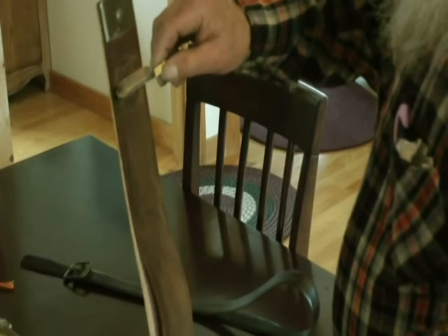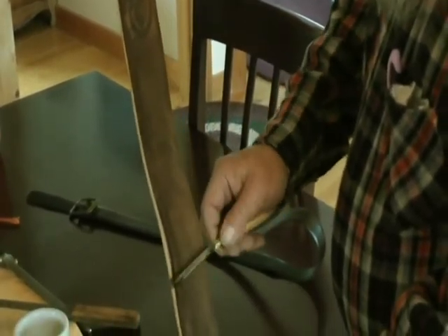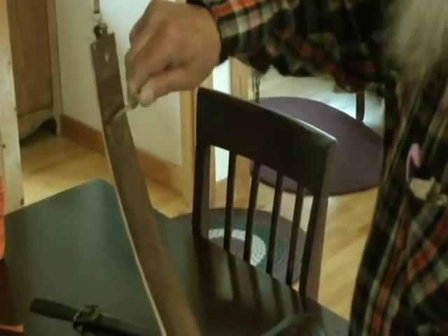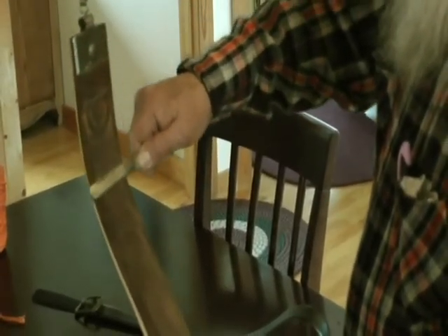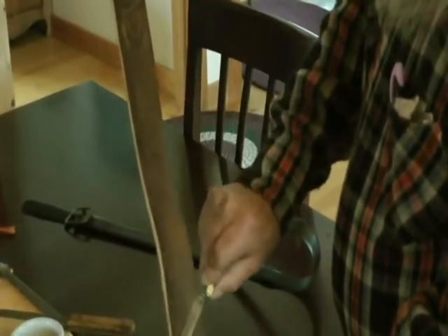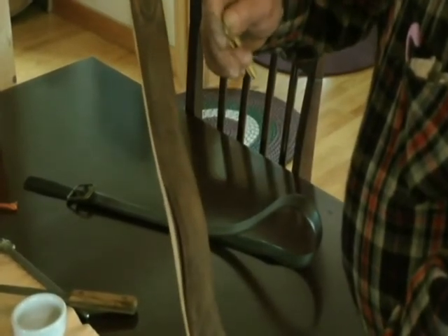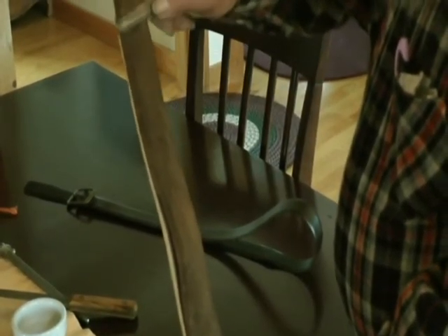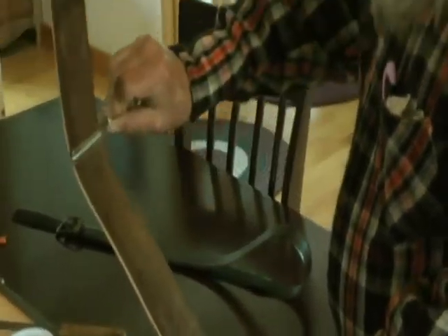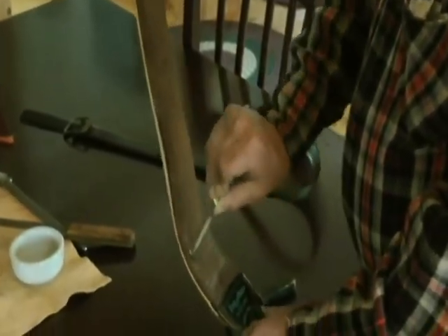That's the proper way to hold the blade when you're actually doing it. You hold the blade so that when you come down, you flip the sharp edge of the blade up over the top and go back down. Flip the sharp edge over like so. You never want to go back with the edge leading — that's what instinctively you may want to do, but the proper way — which will save your edge and save your blade — is to always roll that edge over the top.